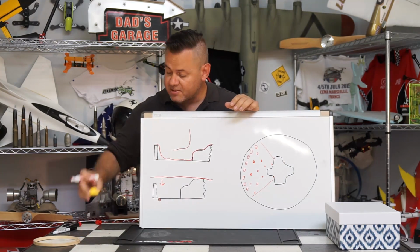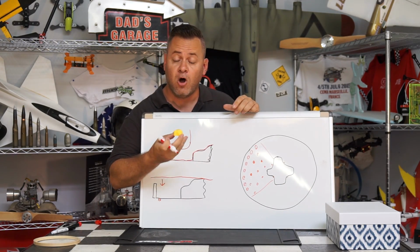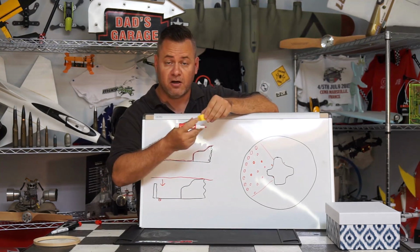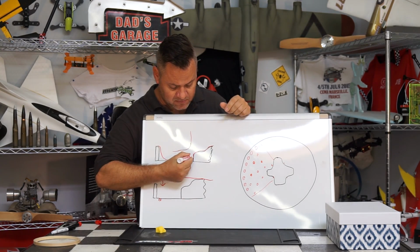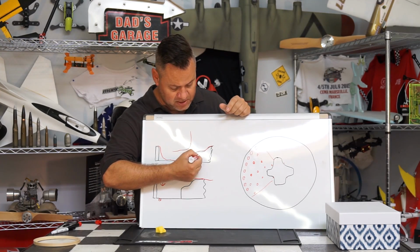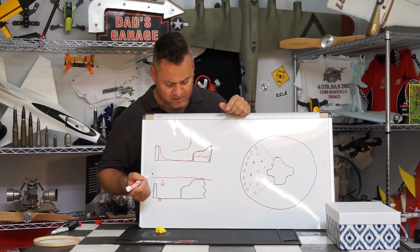And that's the reason when we designed our part, we made it taller than necessary. One, we're going to have to do the trim line on it, but then two is because of this that's going to happen right in here. So our trim line on our mold, where we actually need it, and we're going to be cutting it with the scissors, is something like that.